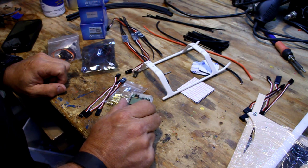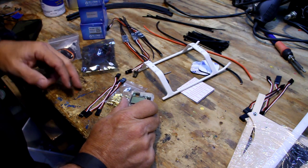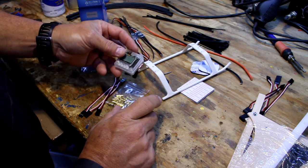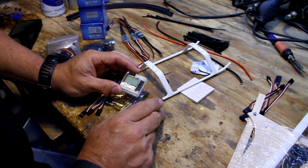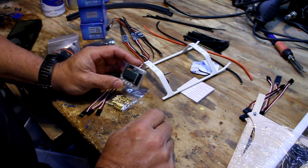I'll explain how to hook this up and set it up. All the boards I sell are flashed to version 1.17 or 1.19 — most of them 1.17 because it's a really good flash. If you buy this at Hobby King, even when I bought from my supplier they came with 1.9 on it, which is not good. As long as it's 1.12 and above it's going to be a good flying board and everything will work like it's supposed to.